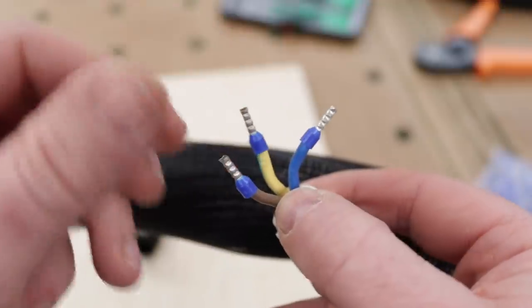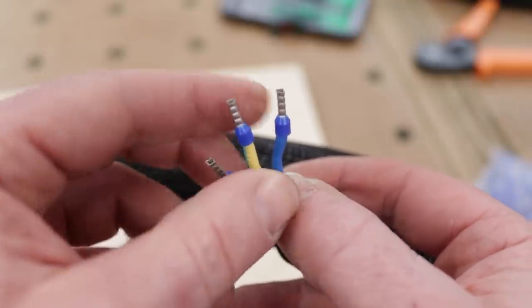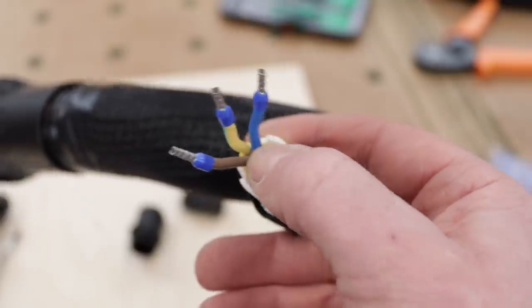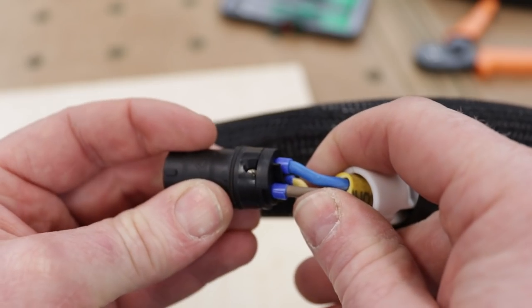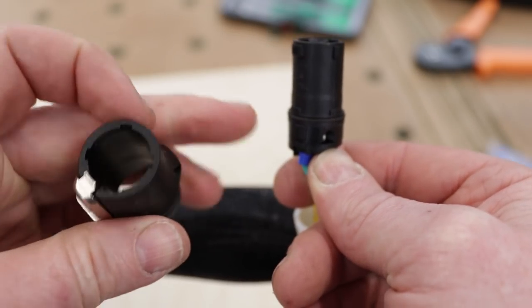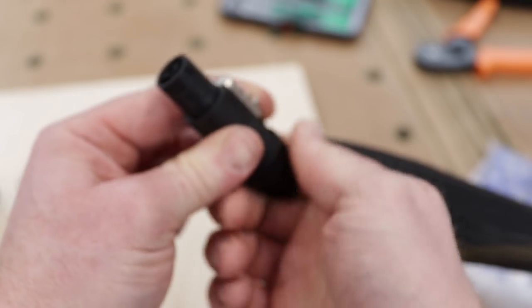There's the ideal scenario - flexible cables with ferrules on the ends, as all flexible cables should have. If you don't have access to ferrule crimpers, just watch my previous video for how to make good connections. But if you do have access to them, absolutely put ferrules on because they're much better for stranded cable - a much better connection ensuring no strands are loose, everything contained within the ferrule. There's the socket all connected up - you can see the nice job the ferrules do, ensuring no copper strands are popping out. Now get the socket inside its housing, line up the large locator pin with the slot, push it home, and pull it through so the socket protrudes its housing.